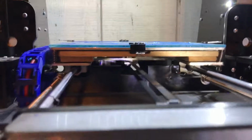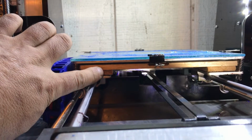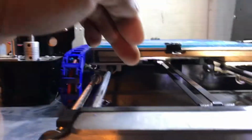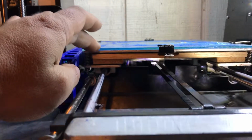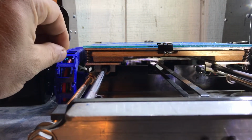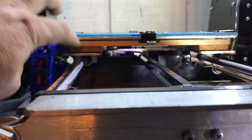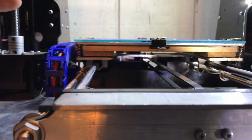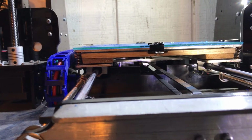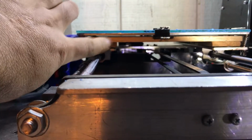This is also very important, especially for printing ABS. If you do that, you will be able to print ABS. If not, you can't, because it's hard to get the temperature to the 90s without this isolation. The heat dissipates downward, and you don't have enough power for the heat bed to hit 90 degrees Celsius. As soon as you put isolation here with balsa wood or cork under the table, it's very easy to print ABS, because you get 90 degrees in maybe 10-15 minutes maximum. You get 90C for the bed. So that's also very important for ABS printing.